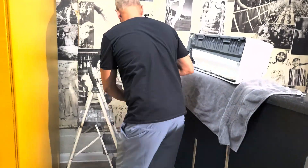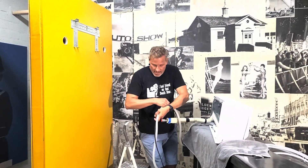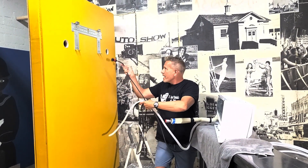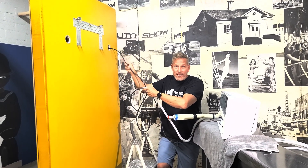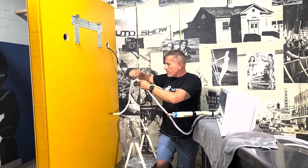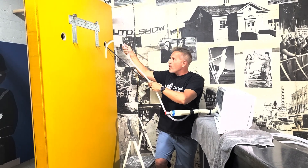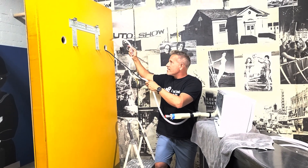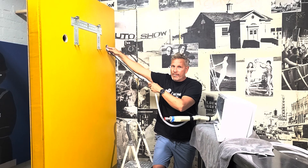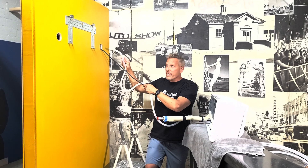First we'll put in the communication control wire. This hole obviously goes through to the outside, so your holes can go all the way from the inside wall to the outside wall. Next, the condensate hose — remember, once this is all said and done, you always want and need that condensate hose to be on the bottom. Because if it's twisted around the line set, water doesn't like to roll uphill, so keep it on the bottom.